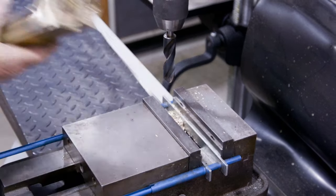So how I'm handling this: I want to get this bearing housing right dead center. You don't want this to look cattywampus. The way I thought about doing it is with this piece of three inch pipe, measuring all around finding the center of this ring gear. This took a little bit of time to get everything in position just right. I also clamped the ring gear down to the welding table — I didn't want anything to move around. I used mag squares on all four corners to get everything nicely centered and plumbed into position. I'm pretty happy with that.